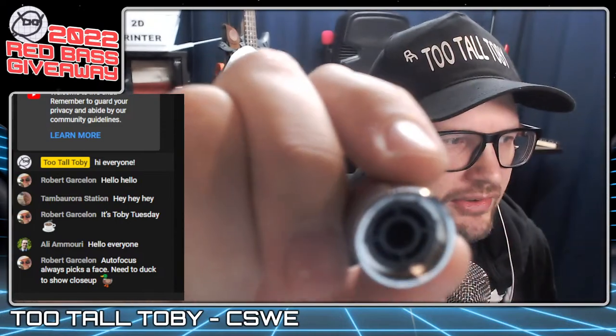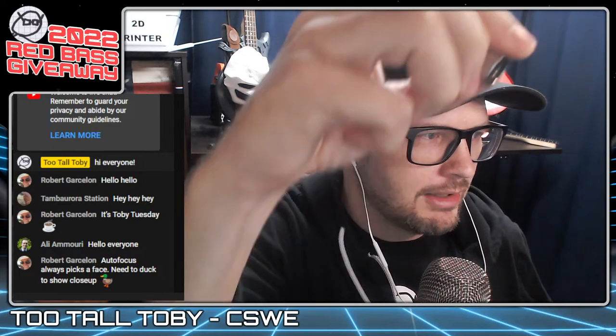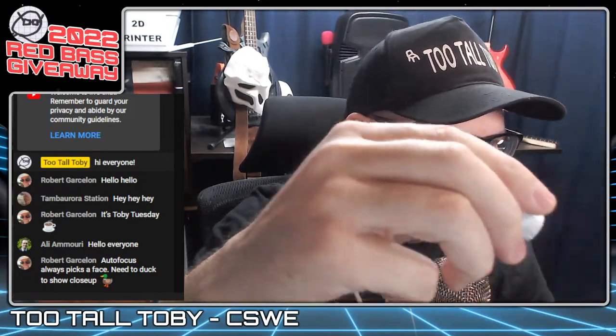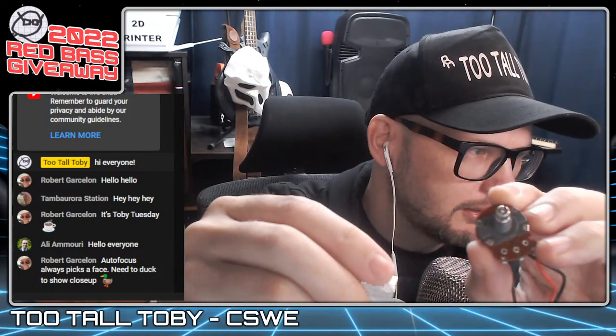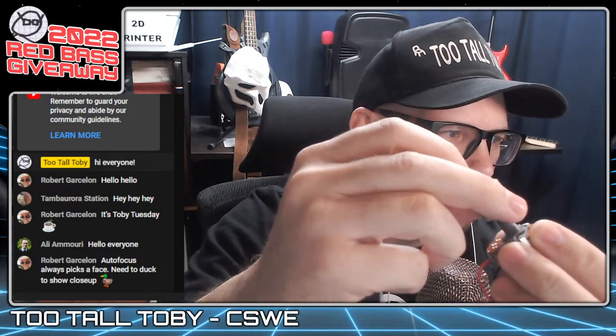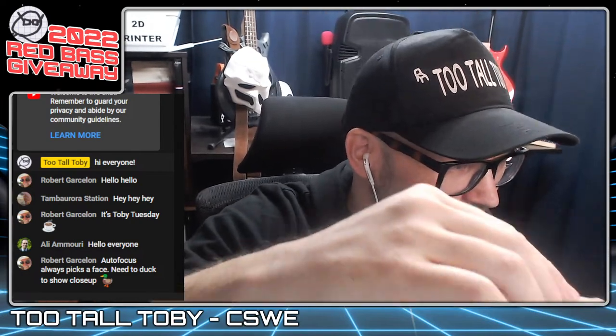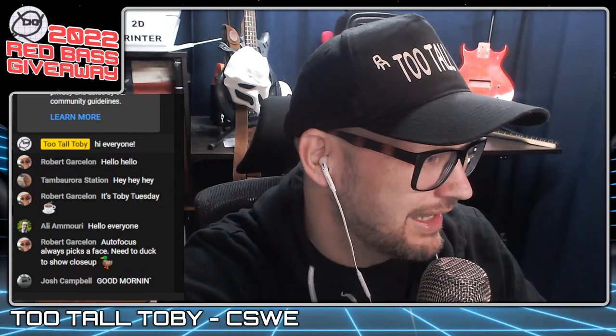Guys, see that? It's got a plastic insert. That's because this thing has a compression fit. So it pushes down over top of the potentiometer. Here's the potentiometer. The knobby needs to push down onto it. Sometimes these things don't have that insert, and there's actually a set screw that goes in from the side. But in the case of this design, it's a compression fit. You just push that down on there. Really jam it down. It's really good for the electronics to be pushing down in this direction. That really leads to a sustainable design.